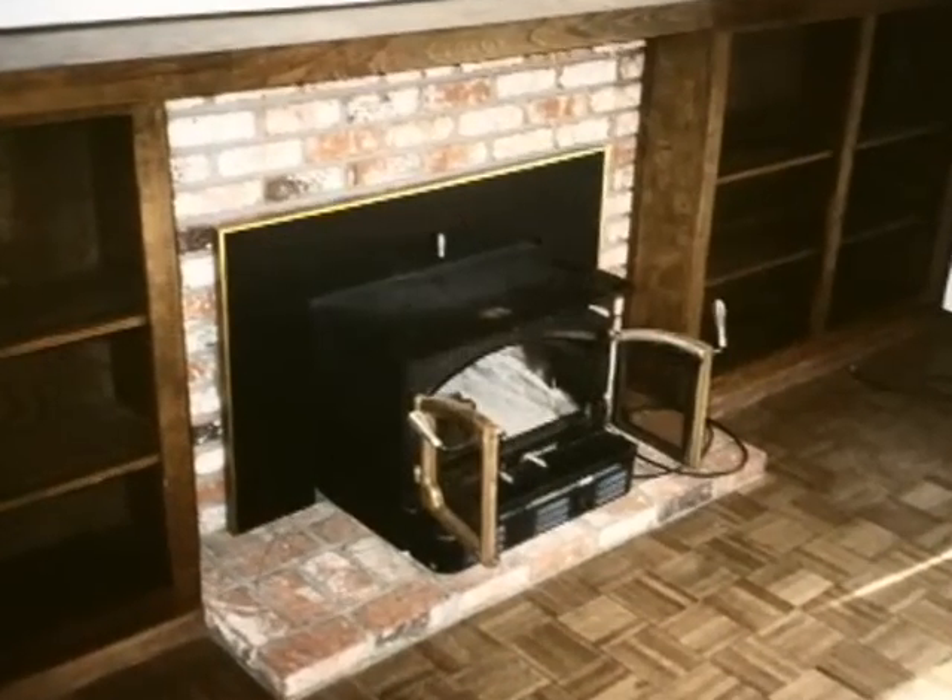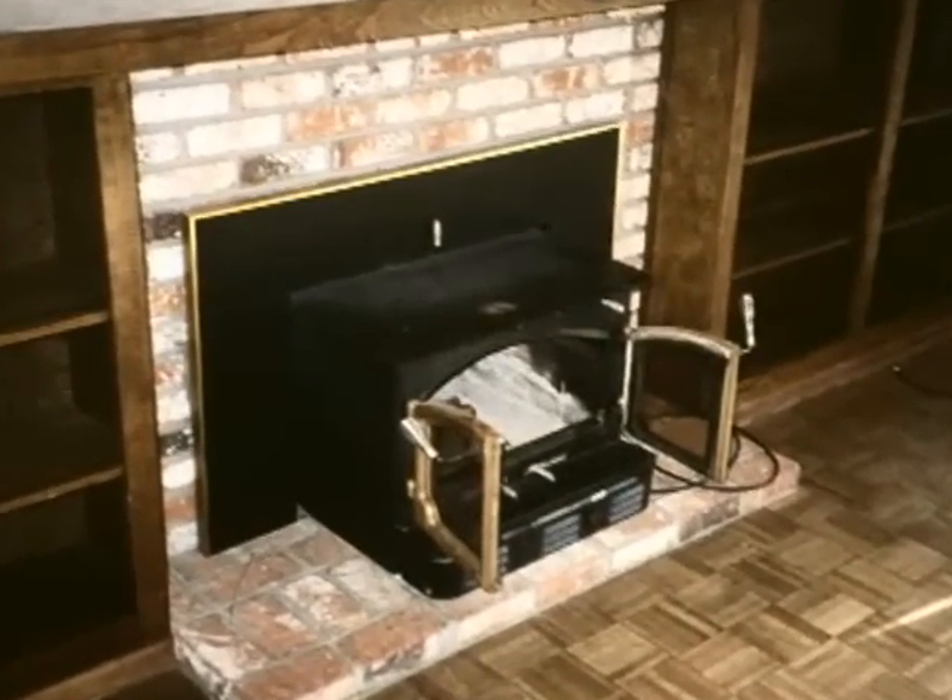Can you tell us a little bit about freestanding fireplaces and inserts? One of the things we see with a large fireplace like this is people want to use it to gain heat in the home, so they might take an insert and jam it in here. Inserts typically stick out quite a ways — a front that sticks out eight or ten inches out in front of the opening. This hearth extension was designed for this opening, not one at eight or ten inches. So when you open the front of that unit, you might get embers falling out and have a fire. We see that very often.